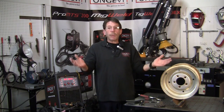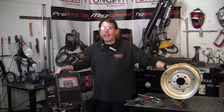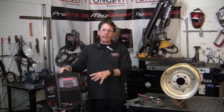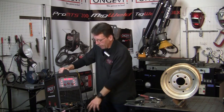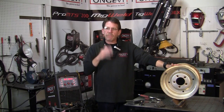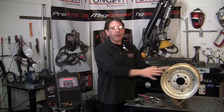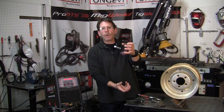You can buy new, more expensive ones, but that's not what I'm about — it's a do-it-yourself kind of thing. Today we're going to use our Innovator 255i. We're going to use the plasma end of it, and it's hooked up for TIG welding right now. I'm going to show you how to hook up the gun for the plasma, and we're just going to cut this rim right in half at the seam. That's going to be our base for the turntable — we'll put the tabletop on top and underneath we'll come in with the sprocket and motor.